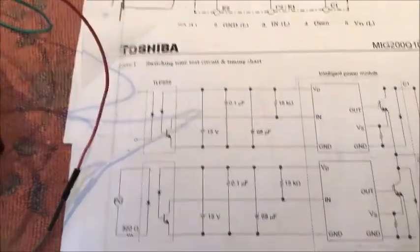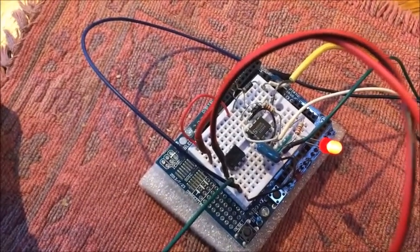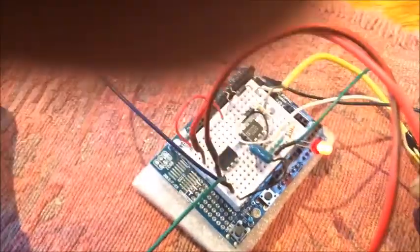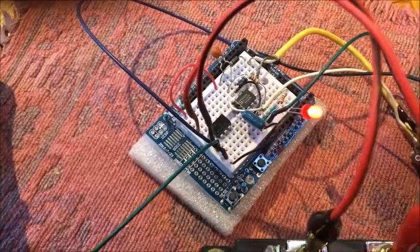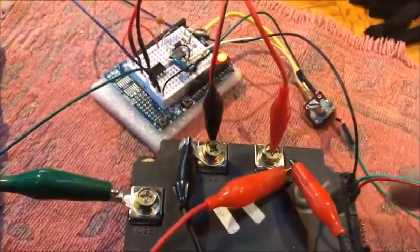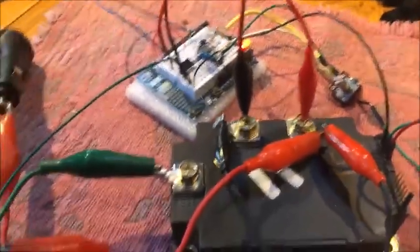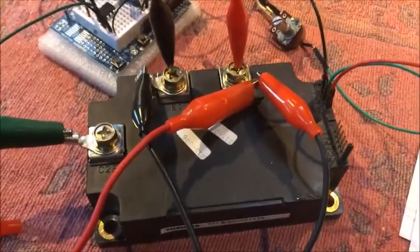When this device turns on, the light comes on. Over here is the pulse width modulator — just a 555 timer set up in oscillator mode with variable pulse width. You can see the LED, which dims and gets bright when I adjust the potentiometer — it's just a visual indication that the circuit is working. Then we've hooked up the IGBT in a test mode; you can see one half is connected, and that's our lamp over here, an LED.